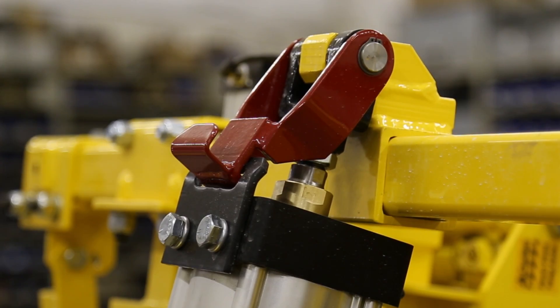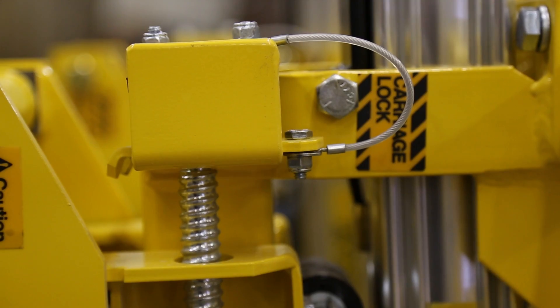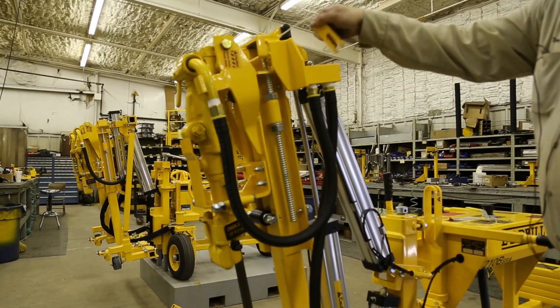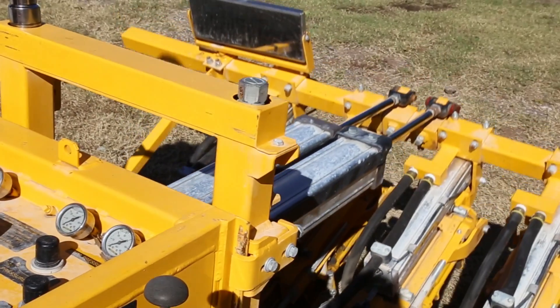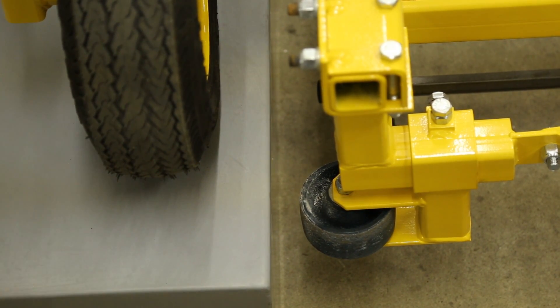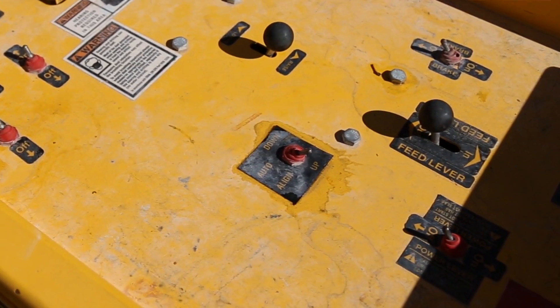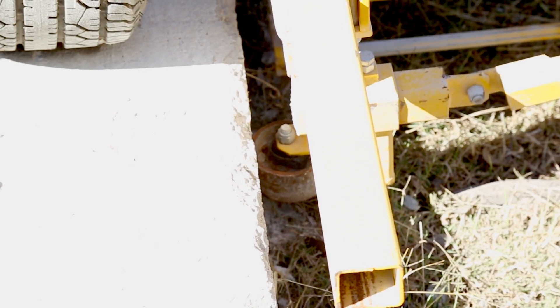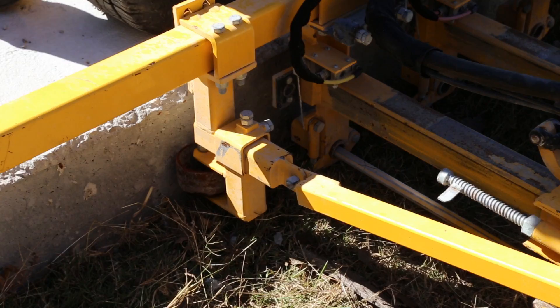Once the drill is in position, unlock the red safety latch on the raise and lower cylinders and all of the individual carriage locks. Be careful not to pinch your hands while doing so. Set the raise and lower valve to the lower position — the drill systems will now drop into the horizontal position. Make sure everyone is clear of the unit during this process. If the guide plates or guide wheels are not touching the surface of the concrete, make sure auto-align is set to up and maneuver the drill until they do. Then place the auto-align switch to the down position.